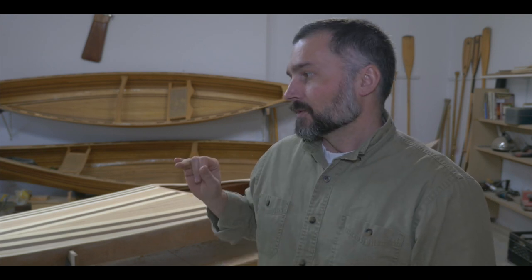Okay, so I just finished off sanding with the 60 grit paper, and I'm going to start sanding with the 100 grit now. I'm going to keep using the orbital sander for now. What I've done also is I've just wiped off any dust off the top of the deck so that I had a better look and I can identify any spots that I might need to give some special attention to. One thing that I want to point out is when you move up to higher grit paper, make sure that you don't hold your orbital sander in one spot. It doesn't happen all the time, but you can bruise or just create weird swirl type marks in the grain of the wood. So just make sure you continue to move the orbital sander around and you should get a good finish.